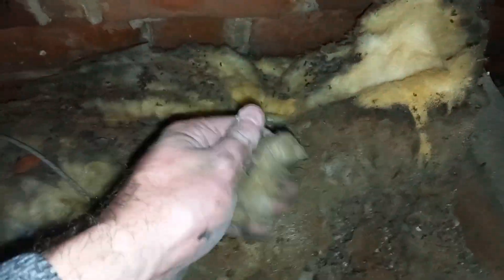This wall - whilst I wouldn't say it's wet - it's definitely damp, and that looks like signs of damp where it's black. This insulation here as well - it's not wet but it's definitely got moisture in it. So I'm going to say for sure that either the flashing is leaking or the ridge tiles are leaking on top. Having said that, there's nothing wet on that board, which sort of rules out the ridge tiles - so it's either the end ridge tile or the flashing.